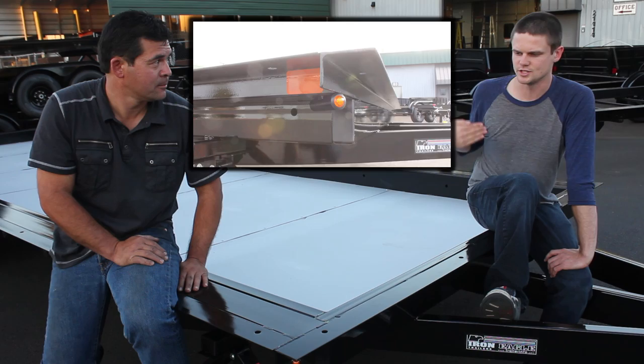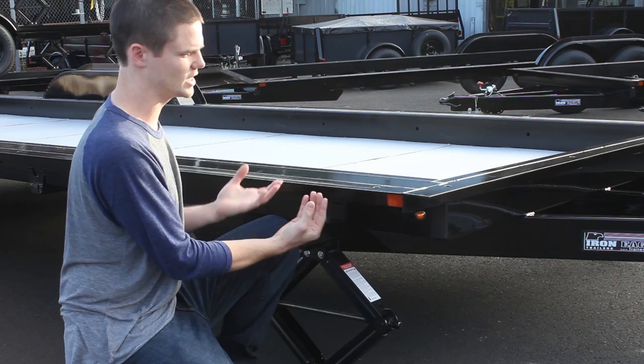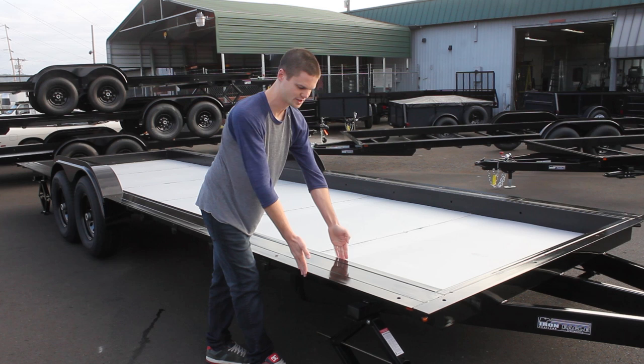Right, because our model only had flanges on the sides, so we had to anchor our front and back walls differently. Another thing we should mention is that we actually passed electrical and plumbing through the flange as a way to get into the wall cavity, because it's sitting right over top, and to avoid having an extra penetration on the exterior, like through the siding.